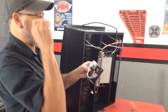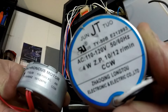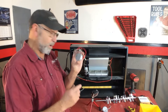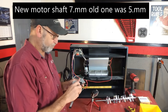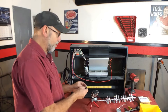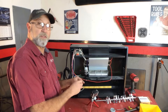It's an AC 110–120 volt motor. After about a couple of weeks I finally got the right motor. It is a little bit different, but the rotation is correct — counterclockwise at 10 to 12 rotations — and that's what I've got right here, the Brandon motor. One of the problems we ran into is the shaft itself is a little bit narrower than the one I got. I took the caliper and measured it, coming up with about 8 millimeters. So I'm going to have to drill out where it goes into the motor shaft itself — here's the old one and it slid right on there. With the new one I'm going to have to drill that out.